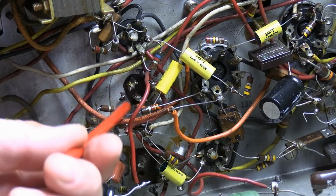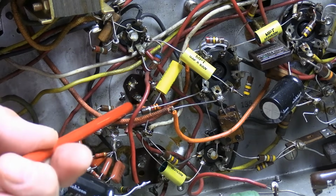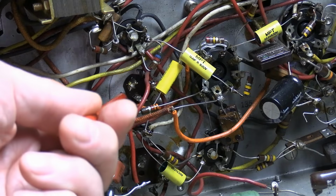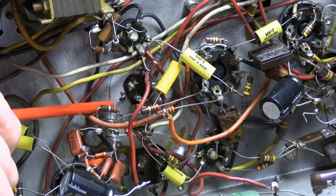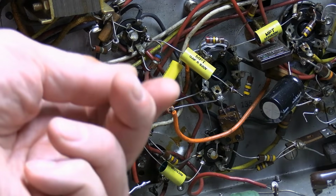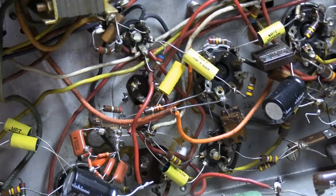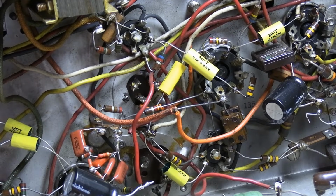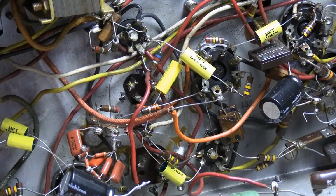Usually there's just 4 slots stamped into the chassis and a square hole for the lugs, and they feed through these twist lock tabs and twist them around, and that's it. For some reason, there's a subplate on these that's riveted. If we drill that out, I think these rivet holes line up with those adapter caps I talked about earlier. Somewhat controversial, yes, it will alter the original look of it.